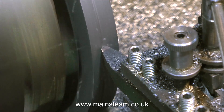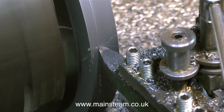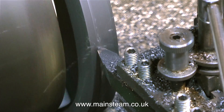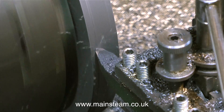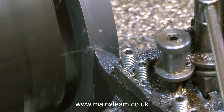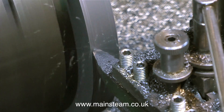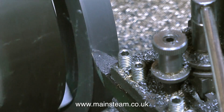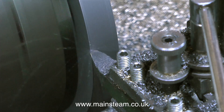Why did I select a piece of metal with a great big hole in the middle? Well, that's quite simple. The ashes will fall from the fire through the fire bars into the ash pan, but the ashes immediately underneath the grate in the centre part of the ash pan will be very hot indeed. That is the logic for getting a piece of metal with a large hole in the middle — the heat from the hot ashes sat in the middle of the ash pan will not be directly conducted to the main metal base plate, and the wooden board that the mounting base is going to be screwed to shouldn't get burnt.